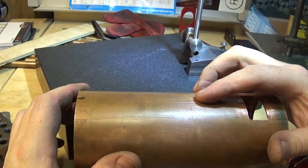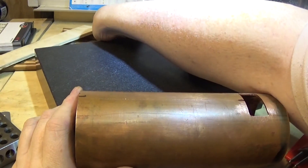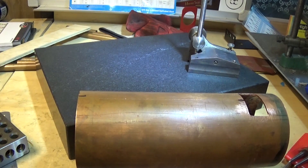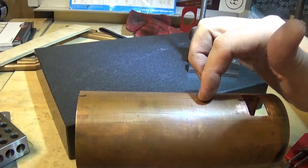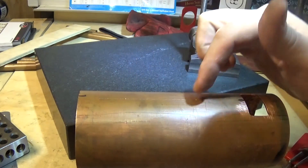These bushes, I think, need to be made from a bit of that bronze bar, which is about 14mm diameter — we'll use most of that I think. They've got 7/32 threads in them, which is just under a quarter inch. To drill these, 10mm will be plenty good enough. I want to drill these first to make the bushes to fit. I'm probably going to run them through with a step drill, which is probably the easiest way. I won't take you across to the drill press again but I'm just going to drill these 10mm.